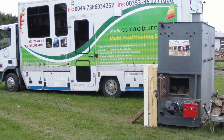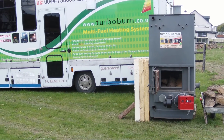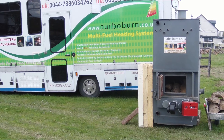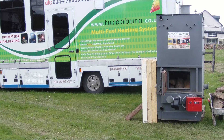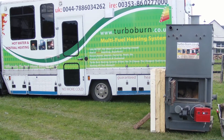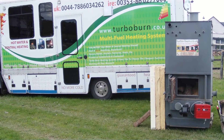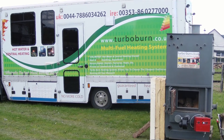This unit is installed in Ireland. The fan in the middle is a turbo fan — when the fire is lit, this fan comes on and forces the combustion. We don't smolder; our fires burn very fast and very hot. When it reaches the target temperature, the fan cuts off, and the oil burner works the same way, all controlled by stats.